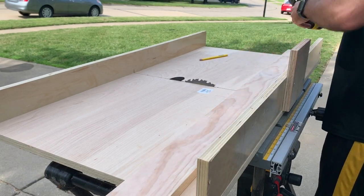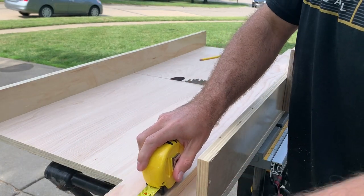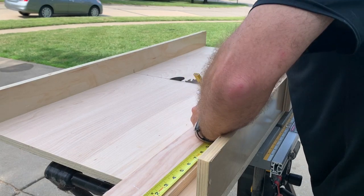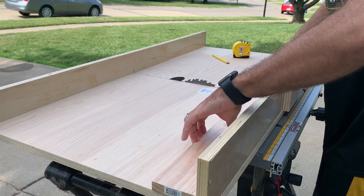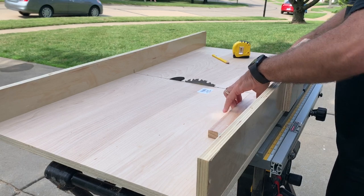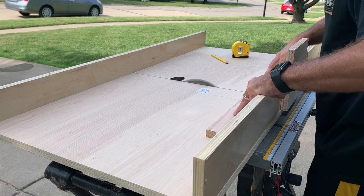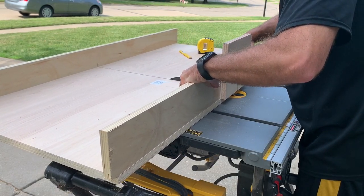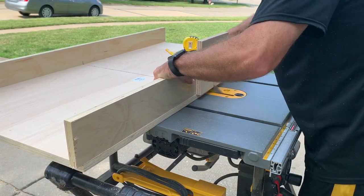This is where the oak boards come into play. I used the 1x2 boards for the vertical rails or vertical supports on the edges, and the 1x4 for the length of the rails. I used the crosscut sled again to get a real square even cut. Then just like I did with the other material, I ran all of this through the router so we'd have nice rounded-over edges, and then sanded it all to 120 before we painted.